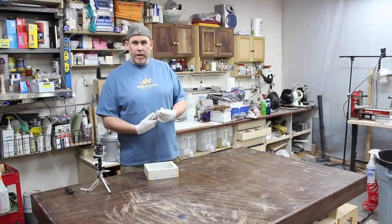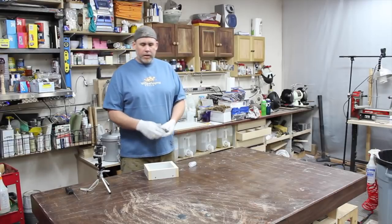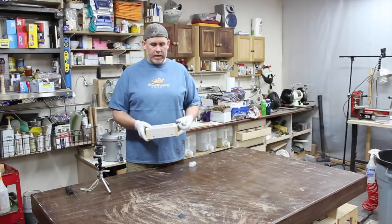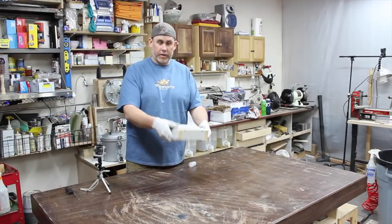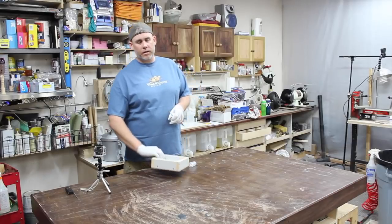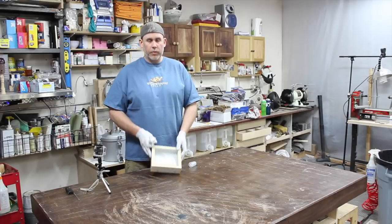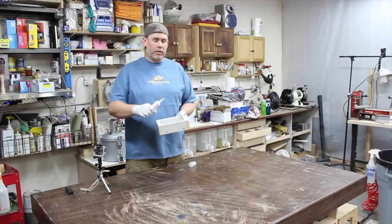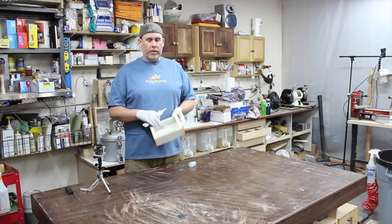I'm going to quickly show you how I do this, and the one thing is, if you're going to do the silicone, you do not want to be taking this thing apart every time. And you don't have to. That's a nice thing. If there's nothing for it to grab onto, all you do is dump it, tip it over, and it just falls right out. You know, you're casting. I've never had to take any of these apart once I used the silicone, except for one time, and that was because I didn't use Stoner. So you will have to use the mold release spray every time, and give it a really good shot of that stuff the first one. But after that, just spray it down, and your castings will come right out.